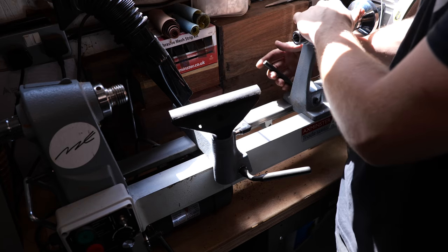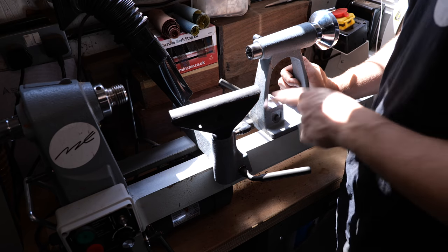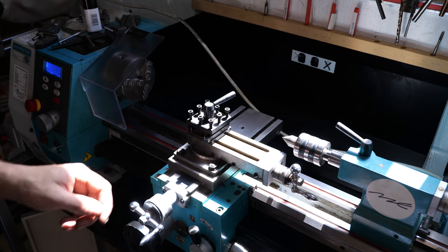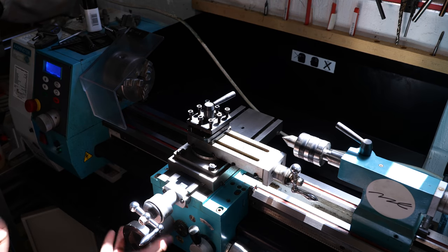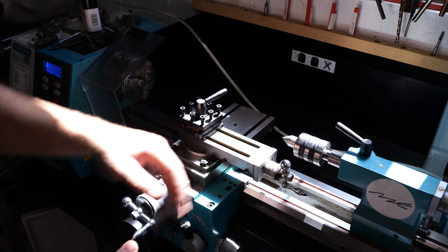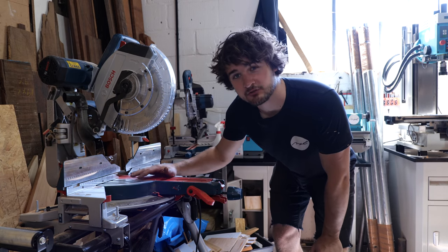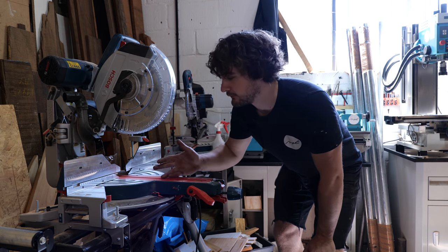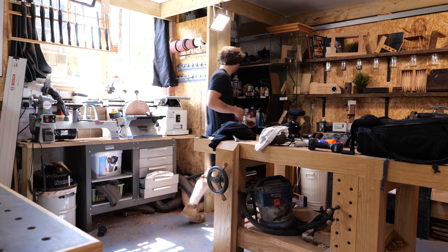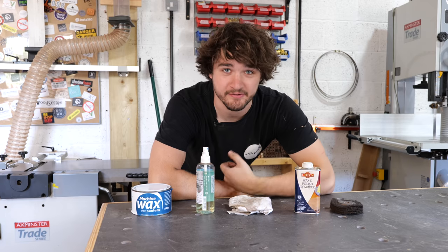Now, do you really want to be waxing a surface that has a locking thing on it and a tailstock locked down onto it? You want that to be somewhat grippy but definitely not slippy. Same again on the milling machine — you kind of want that to be grippy. And then the metal lathe bed: technically we want this to be slippy because most of it is done on the feed, but because it's a metalworking machine it's best to grease and oil it instead — you don't really want to be putting wax on it. The mitre saw is all aluminium so it doesn't rust and I just give it a hoover down from time to time.